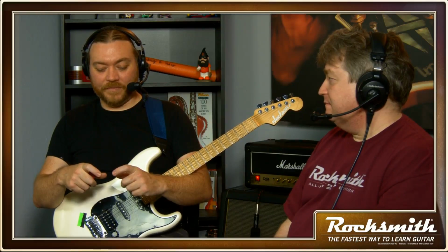A plate reverb is another type of electromechanical reverb that was used in recording studios, where you would have a giant steel or brass or even gold-coated brass plate in a huge trench underneath your studio. You would send electrical signals through this plate, and they would propagate through the plate at different speeds, and the plate would resonate. There's actually a little transducer, like a speaker, attached to one end of the plate and a little pickup microphone at the other.